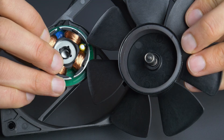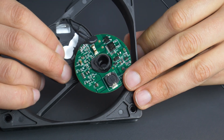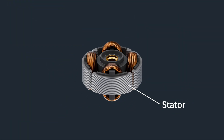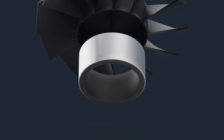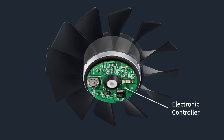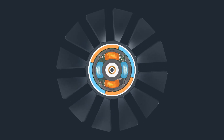I'm using this example from Orion Fans that I also gently disassembled. You can see that there are many similar parts but they're arranged differently, and there are some driving electronics as well. A key difference is obviously the lack of brushes. Just like with a brushed motor, the brushless motor has a stator which is almost always fixed. Next is the rotor, which contains the permanent magnets and in this case are mounted inside the fan blade itself. Now instead of brushes and a commutator, you have an electronic controller that has some sensors and logic in it. The controller detects or estimates the location of the rotor and then, using switches, changes the polarity of the stator as necessary.